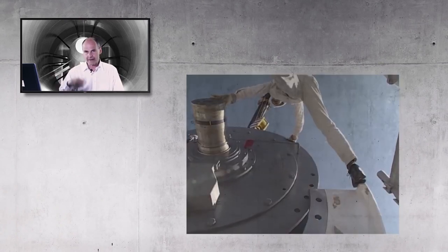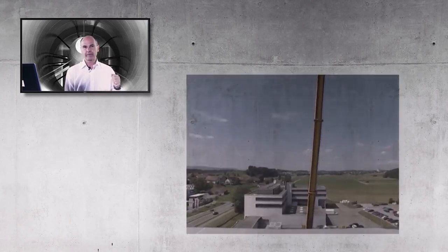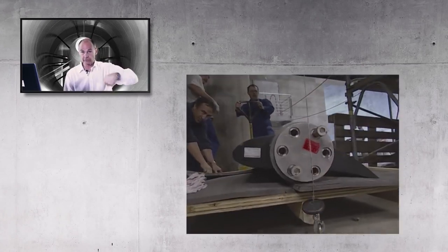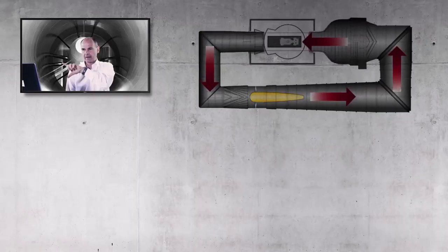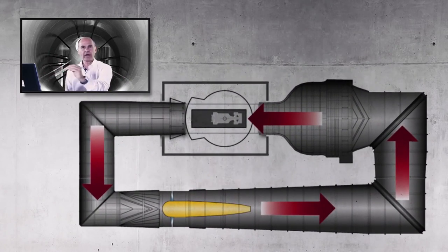And then going a little bit more into the air side, the aerodynamic side of the design of a wind tunnel, if we start with the fan, it blows the air along, it creates turbulence, if you like. A fan will tend to take the air and make it rotate because you're rotating the fan blade. So the fan blades are designed to push the air in one direction, but they add some rotation. So after the fan, we have anti-rotation vanes that try to then re-straighten the flow. We then also expand the air. You see the airline looks like from the fan it's expanding almost all the way to the working section, then it contracts for the working section, and then after the working section it expands again.